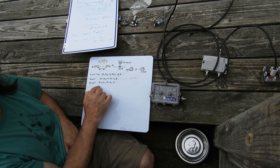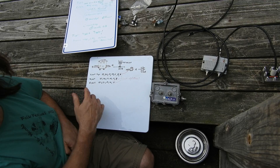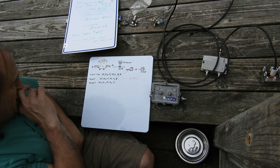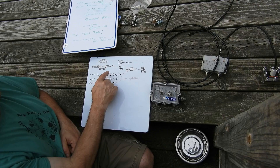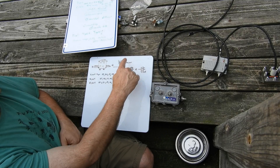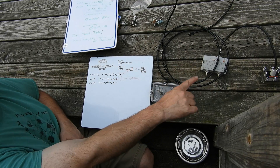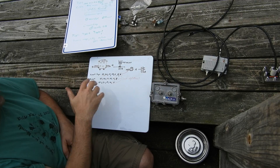It feeds down the cable to the next pole. They start out like a 23 tap — the first pole coming out of an amplifier might be a 23. Some systems start at 26, some at 20, depending on how they're running their amplifiers. 23 is typical; maybe the second tap is a 20, then the next neighbor is a 17, and they may skip to an 11 or all the way down to a four on a long reach. It depends on the footage between the taps.